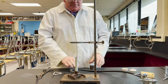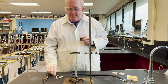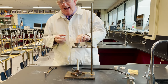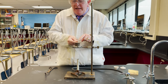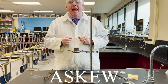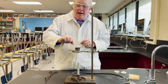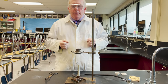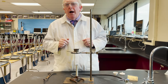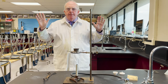Turn that off for now. Typically what we would do is give this a good washing, set the pipe stem triangle there, put the crucible in, and the lid can be on top. It should be slightly askew — A-S-K-E-W, look that up tonight — which means we have a little opening there so that gases can come out. Light this up, run it for about 30 seconds, that's gonna dry the crucible. Turn the flame off and then step back and wait.